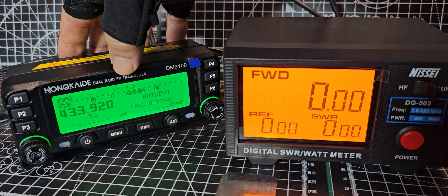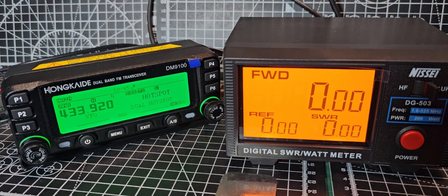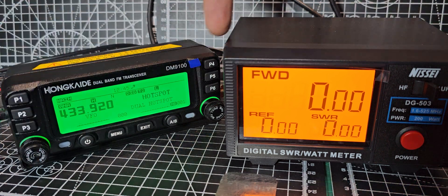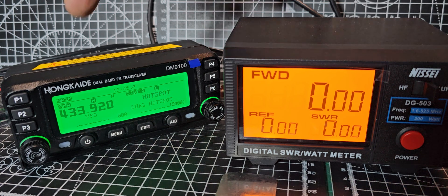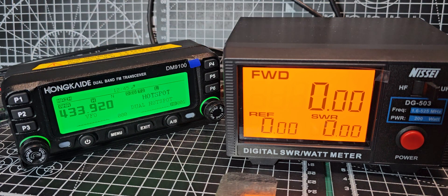There's no back box to this — what you see is what you get. It's fantastic; it has a microphone connector, left and right, and independent controls for A and B. So let's power it up. We're on high power in analog, we're going to transmit using a dummy load. M0FXV test — and look at that: 33 watts. 33, not 25.